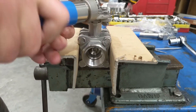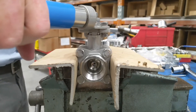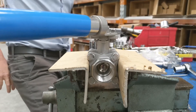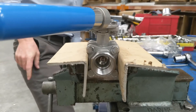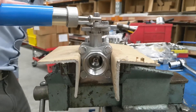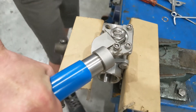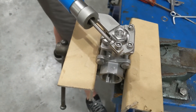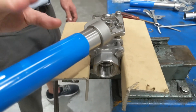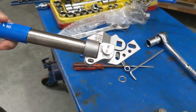Put the handle back on. Now we're ready to operate — tighten it in the vise, pull it open, and the valve is open. Now it's a dead man handle: I let go and the valve goes to its closed position. That's why it's called a dead man — the dead man opens it, he dies, he drops the handle, and it closes. So it's a fail-safe position, either fully open or closed. We've set it up to close. Even if you crack it just a little, the ball valve will start to open and then close when released. We have a couple of different designs; this other design has a slightly longer throw on the handle but works on exactly the same principle.